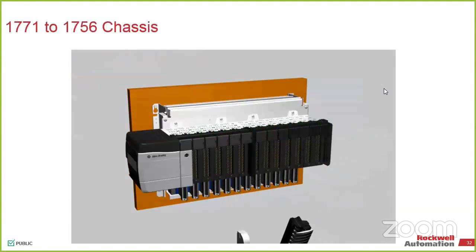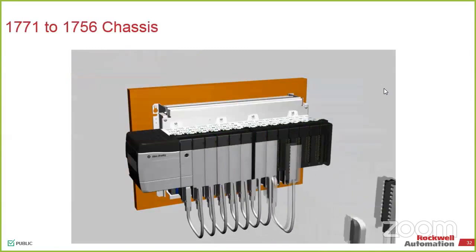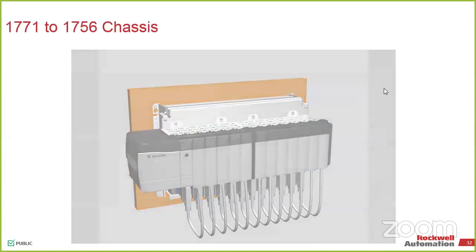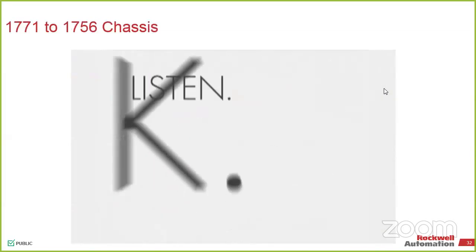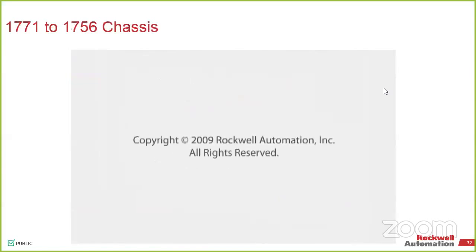You have the option of either replacing the processor or just making it a remote I/O adapter, so EtherNet/IP. That wiring harness now goes in and ties into the existing wiring that you had to new I/O. So within an average of 6 to 7 minutes, you're able to pull that out, pop the new one in there, and you now have a working system.